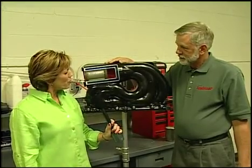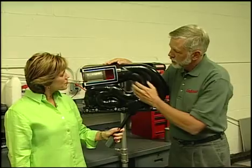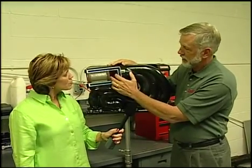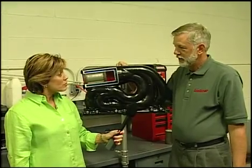So by tuning the exhaust, you can increase the horsepower, right? Oh, absolutely. We've shown no loss in performance compared to our non-catalytic converter engines. Okay, and so then what happens once it gets to the catalyst? Well, there are three harmful gases that enter the catalyst. We have carbon monoxide, hydrocarbons, and oxides of nitrogen.